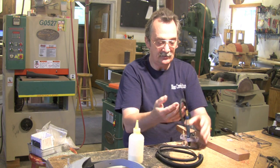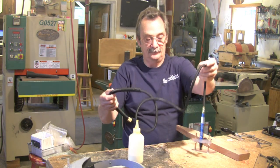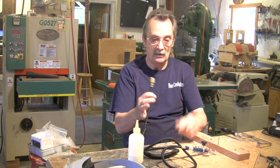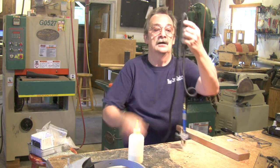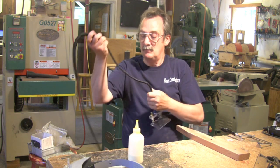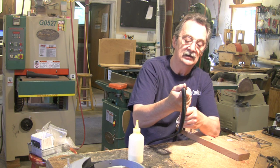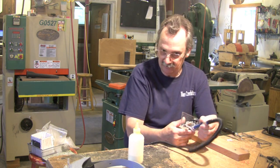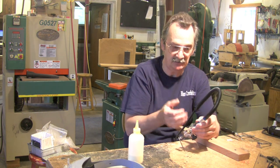Put this together and you'll tighten this up with your wrench. This is your exhaust tube — the air comes through here, and that will have a connection to go into the air compressor. The air exhausts out the top here. You might be thinking you can use the exhaust tube for blowing dust away, but with these tools it's not necessary. They spin so fast they create enough turbulence that they're actually self-clearing.